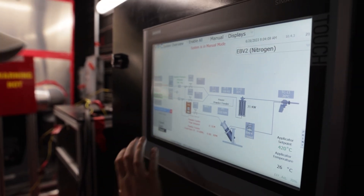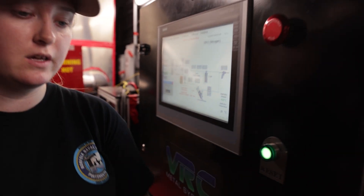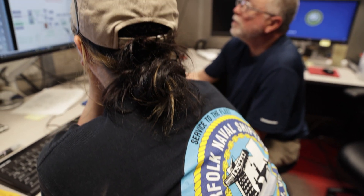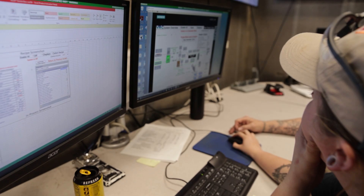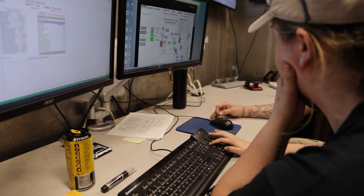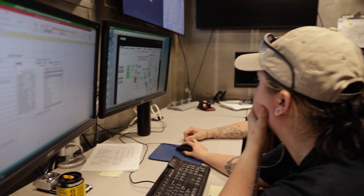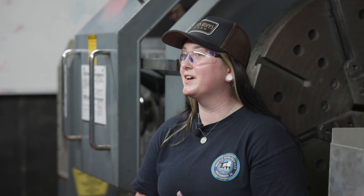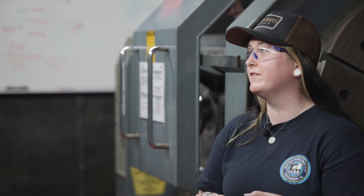I have a whole Excel spreadsheet set up where we track pretty much every single variable you could possibly think of for jobs that we do. With cold spray, a lot of what you have to keep consistent is the temperature, the speed that you're running the robot at, and the air pressure that you're shooting the powder out at. Me and Griswold noticed a couple years ago that the outside environment actually does kind of affect the spray — like the temperature and humidity that day. So sometimes if it's a really finicky powder, we'll put that down on the spreadsheets too.